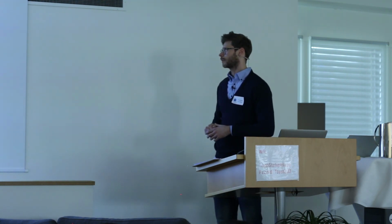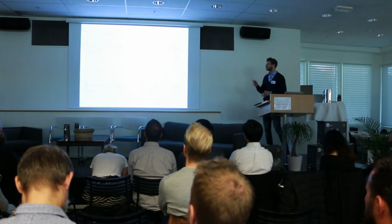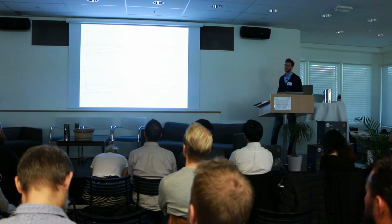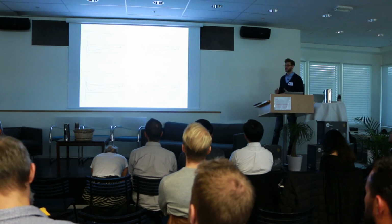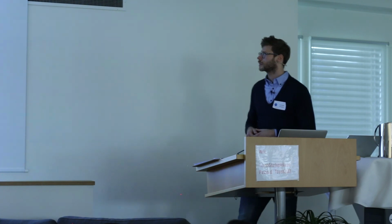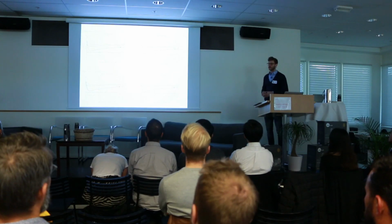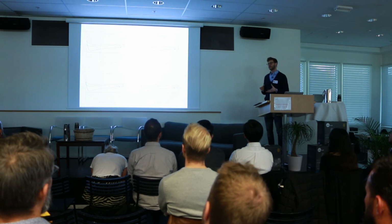And you can see the airflow is fixed at 50%, that's the gray line. The other two lines you see are the blue one, which is the environmental temperature that you can roast based on, and the bean temperature, which you can also roast based on. Then you have a green reference point, which is the profile that it used. If I hadn't taken manual control, it would have followed the green line at the top.